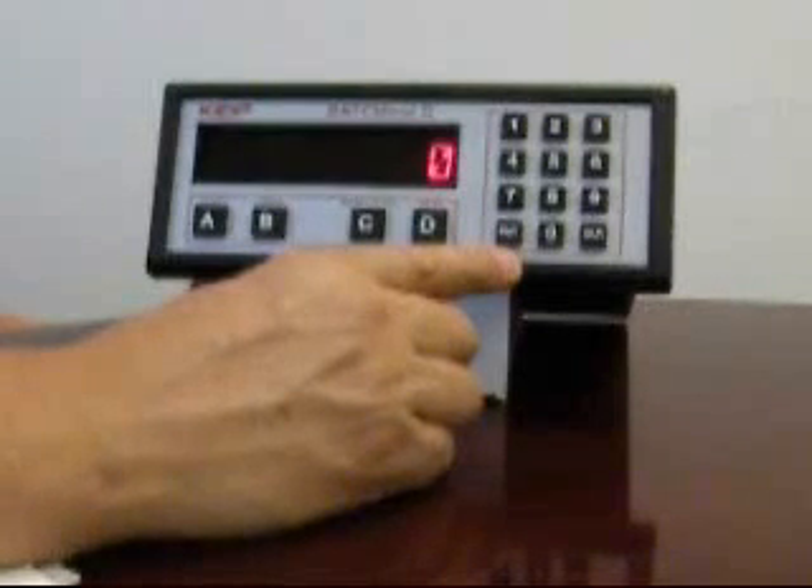This model provides two power supplies that can be used to power your flow meter. There's one that's plus 12 volts available on terminals 13 and 12, and another isolated 12 volts on terminals 16 and 15. These two power supplies can be wired together to provide plus 24 volts, commonly required for some flow meters.